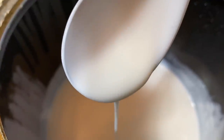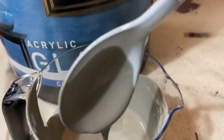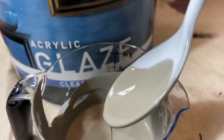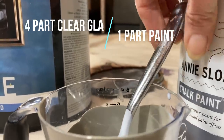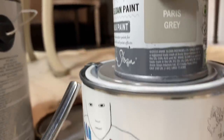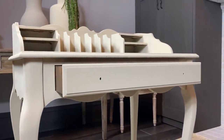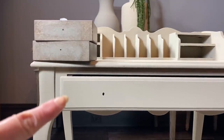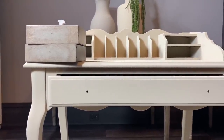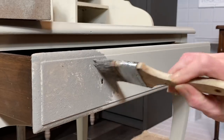Using clear glaze allows for a lot of beautiful faux finishes. I'm going to make a glaze mix with the brown chalk paint as well as a custom French Linen and grey color, adding four parts clear glaze to one part paint. There are glazes that are part of decorative finishes, but this kind of clear glaze is only for decorative purpose — it doesn't seal your projects. Once the base coats are completely dry, we can get into the glazing techniques. This is similar to a ragging technique or a paint wash, but because of the viscosity it's not drippy — it acts as a more translucent color.